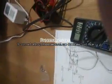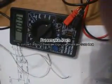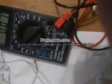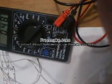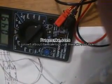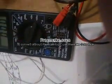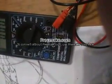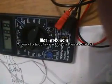So you're going to take, I can hold this. Audio plug here. You want to go from ground, which is the first pin on the connector, to any one of the two of them, depending on which one it's hooked to. So we're testing the first one, which is on the white channel 2. I'm going to go over here and change the voltage down a little bit so we can see it even better. 489 millivolts.